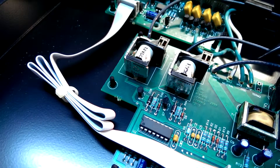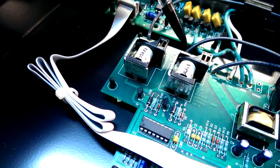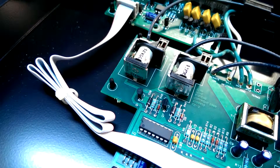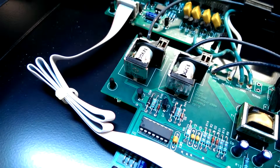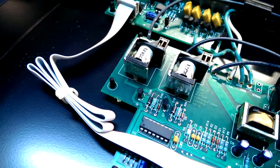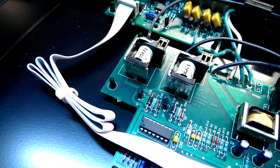Moving over a bit, you can see the date code — Elan Home Systems Copyright 2000. The two relays here are actually pretty nice; they have high-quality contacts and are a decent size. When they were energized they clicked really nicely with no visible spark. This unit isn't a super high-power unit — it's rated 15 amps max. You derate that by 80% and you're not moving a whole lot of power through it, so you wouldn't want to run any high-power amplifiers through this.